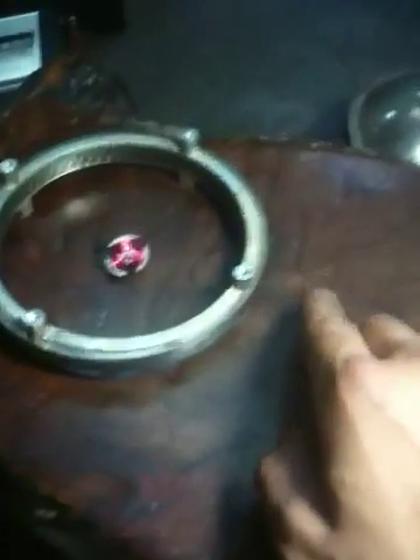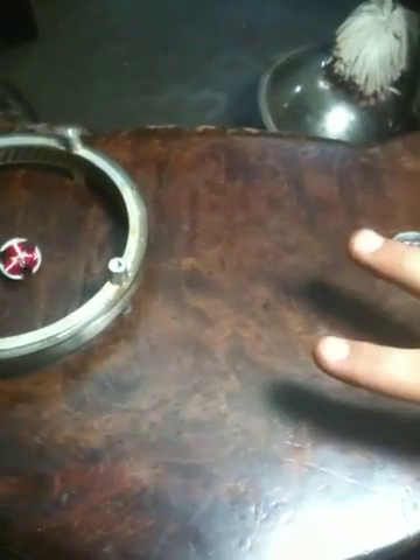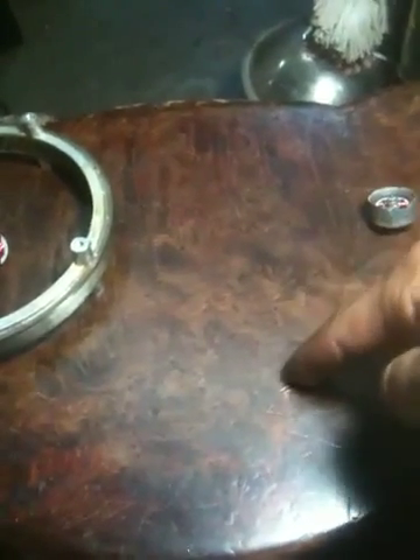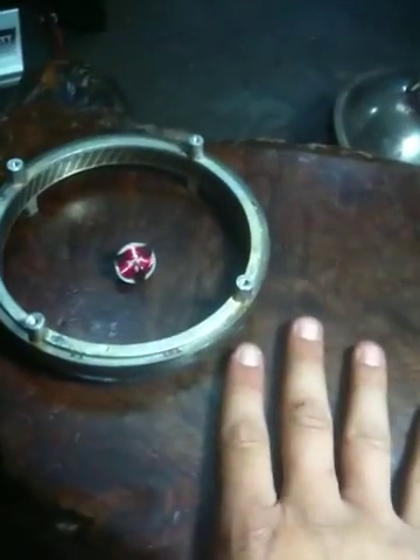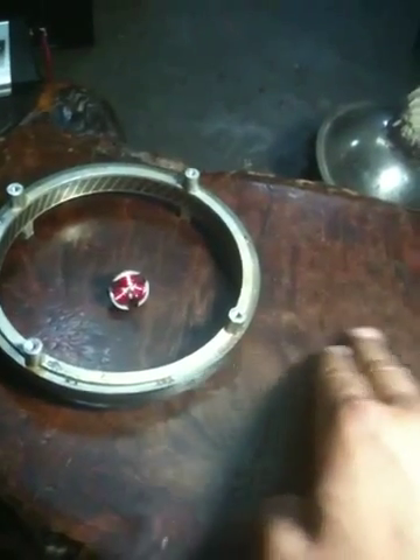So you have one circuit able to go here and here and then back into the motor. In the other circuit you do the same thing — wind one coil here and then another coil here. So you have two coils in this 90 degree cross formation with a north and south stationary magnet and four external circuits made from two wires.